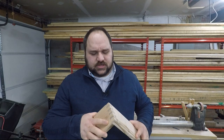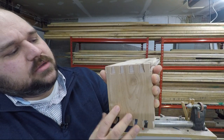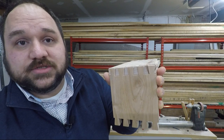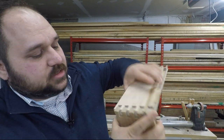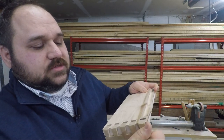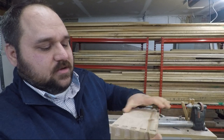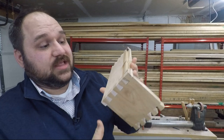There's really two parts to dovetail joints. The first is the tails, which look like a bird's tail or a dove's tail. The second are the pins, which are these inside parts here, so you can see it from that side. And the tails and the pins just kind of fit together. Once that's put in and glued up, that is a very strong joint. That's not going anywhere.